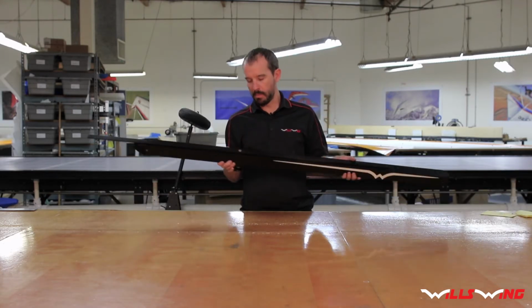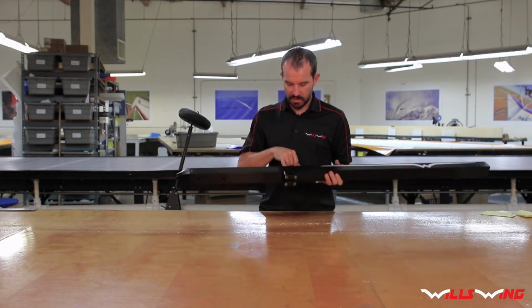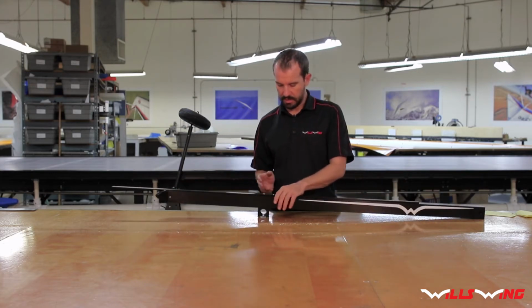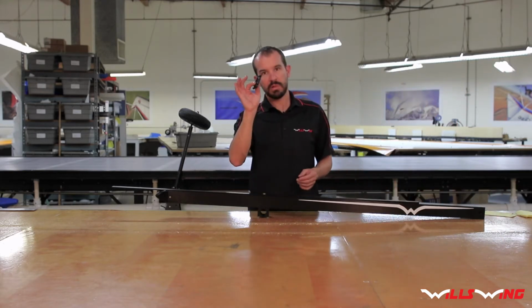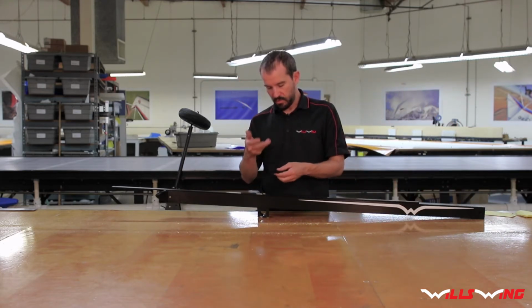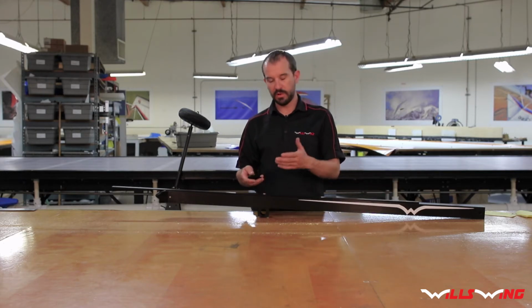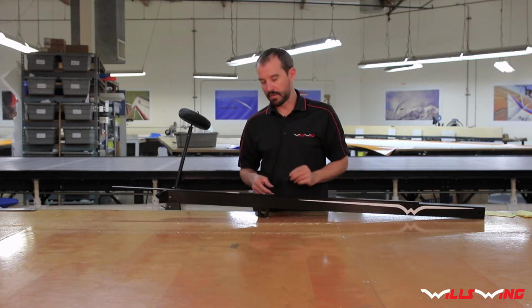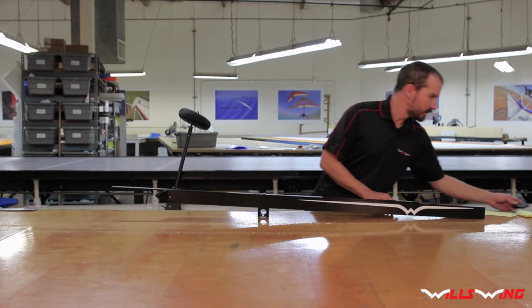Okay, next we want to work on the beam. A word of caution, you're going to need to loosen these 5 bolts. Do not back the screws out all the way. The nuts that secure them are held in place with these plastic nut plates. If you back the screws all the way out, they will come loose and fall out, and it's very difficult to align and reinstall them. So don't do that. I've already done the hard work for you, so just back them out loose enough.